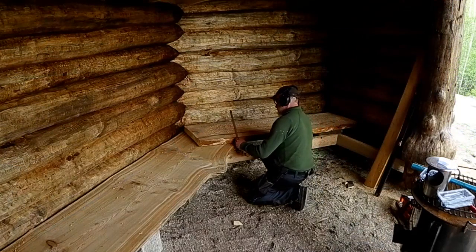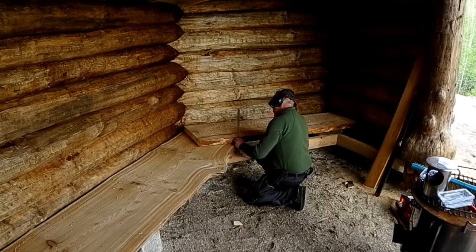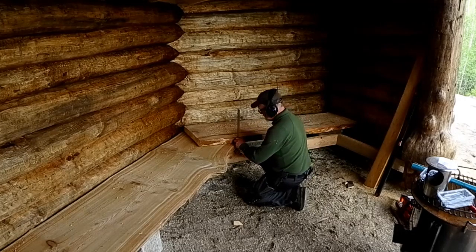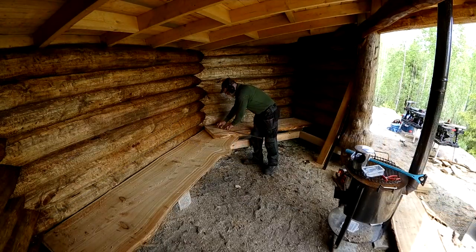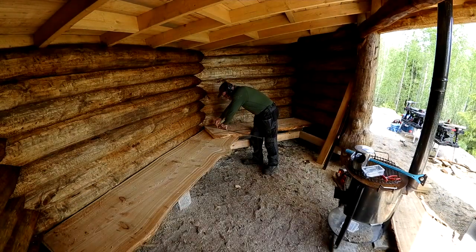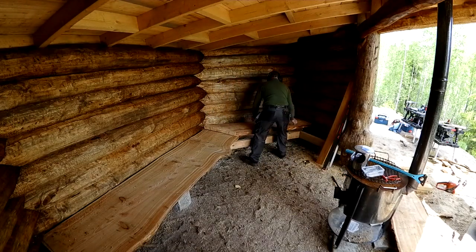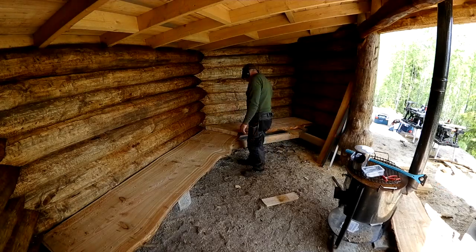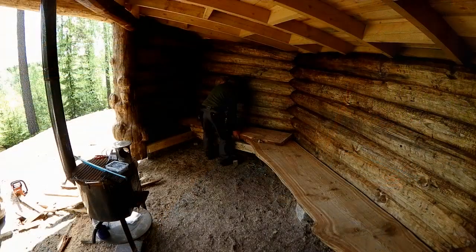Then it's easy enough to just find that point where the two front edges of the two planks cross vertically and make a mark on the top plank. Then draw the top line for cutting that plank. Then of course, once it's cut and repositioned, it serves as the perfect template to draw the cut line on the bottom plank. Rinse and repeat.